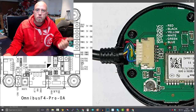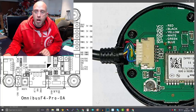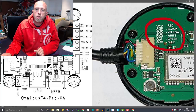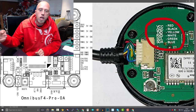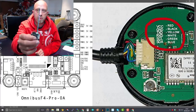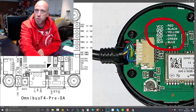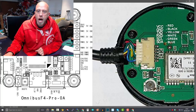In that little connector we have RX6, TX6, ground, five volts, SCL, and SDA. Over on our GPS chip itself, the red wire is VCC — five volts. We match the colors from our GPS unit to the correct pins on the board. We completely ignore the color coding on the cables plugged into the board; we only pay attention to what's coming out of the GPS unit.